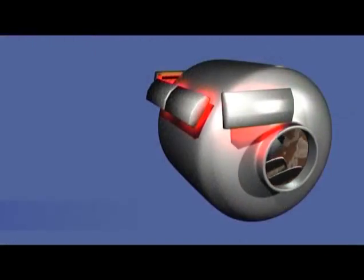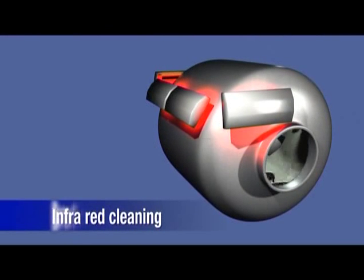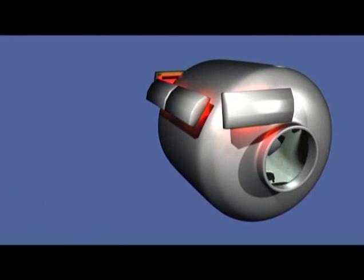The infrared self-cleaning system is unique to Dumoulin. It allows residual chocolate on the inside of the pan to be melted between batches. This chocolate is then picked up by the centers as they are loaded for the next batch. This feature of keeping the pan clean is the key to being able to chocolate coat and varnish in the same machine.